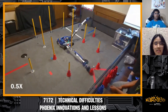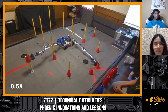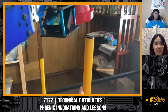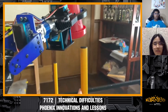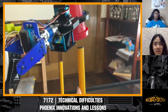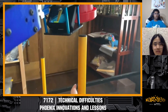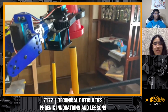Since the arm can reach up to four feet, the possibility for collisions with poles is extremely high, so we use motion profiling to control arm movement. First, the arm retracts the extension and angles the first pivot upward toward the robot. Then the turret turns to its target angle. When the turret finishes, the first pivot and extension move to their targets. At the end of each arm, we have a HuskyLens camera — an AI-enabled camera capable of tag, object, and color recognition with onboard computing. We use it to follow the yellow contour of the pole while scoring in autonomous and tele-op. As HuskyLens had never been used in FTC before, we developed a customized I2C driver to interface with the REV control and expansion hubs through the I2C device ports.